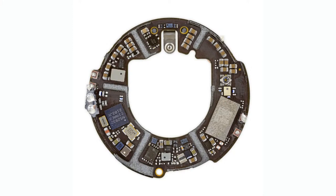One of the things you notice quickly when dealing with Bluetooth and the NRF series is that folks using these chips need them to be very low power. Low power usage is really important because if you're doing cellular or BLE, it's battery powered. A lot of these devices, especially like the AirTag, send data once in a while, not often, and then go to sleep in between. So power management is something that's very important.